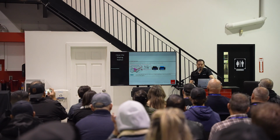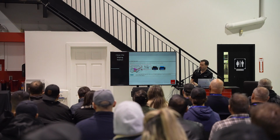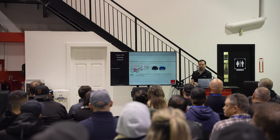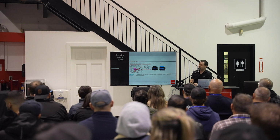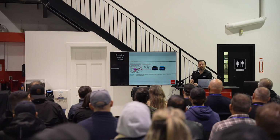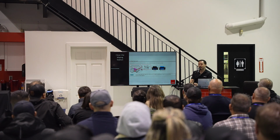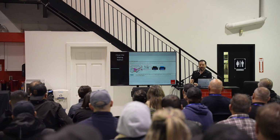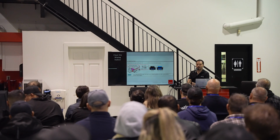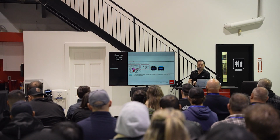All right, and this is a picture of cleaning the wiper. You can see how the buildup would affect it. It's just going to put ink back onto the print head as it's wiping. Just to give you an idea, if I was to see a wiper looking like this in the image, it looks warped. I would probably change this wiper, to be honest. So you're looking for a little warpage, and they're easy to change. You just pull them up, and the new one clicks right in. Changing these kinds of things is really easy.